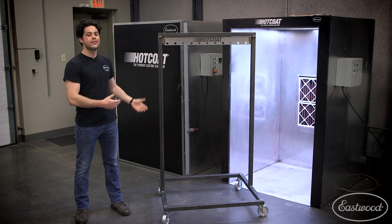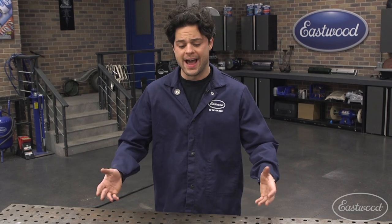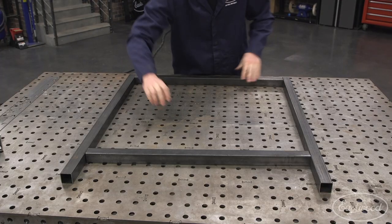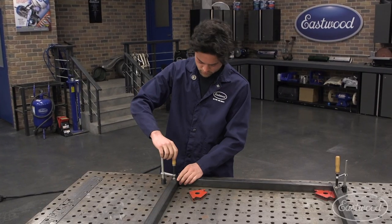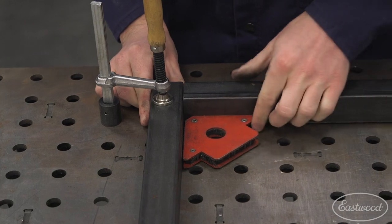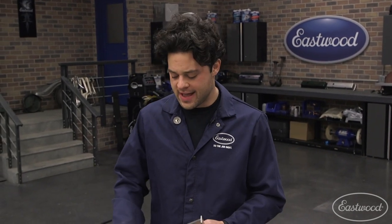Let's head on over to the workbench. We'll get this thing laid out and I'll show you how everything fits together. So we're over at the weld table — you can see I have the welding jacket on. We have everything laid out here: our 30-inch tube, 37, and 58-inch tube. We're going to tack weld all this together, but first we're going to go through with some pre-paint prep and make sure everything is nice and clean. We have our 37s on the outside, 30s on the inside, everything is nice and square and clamped down, so we're gonna run through and tack everything together.